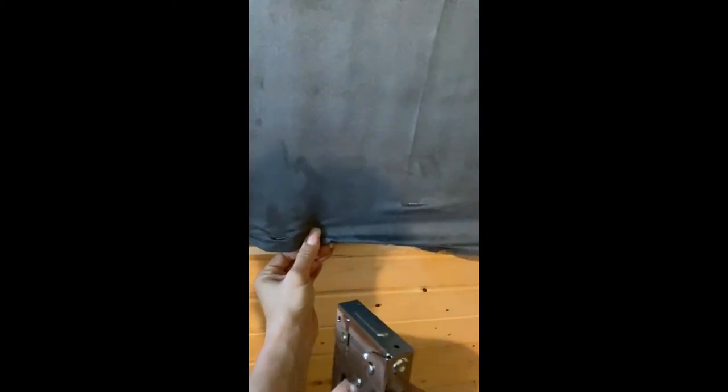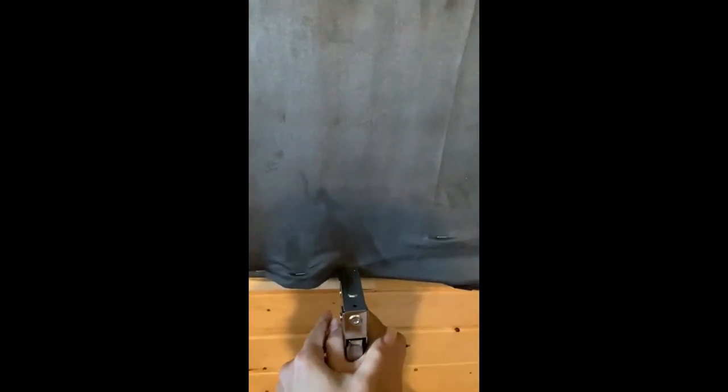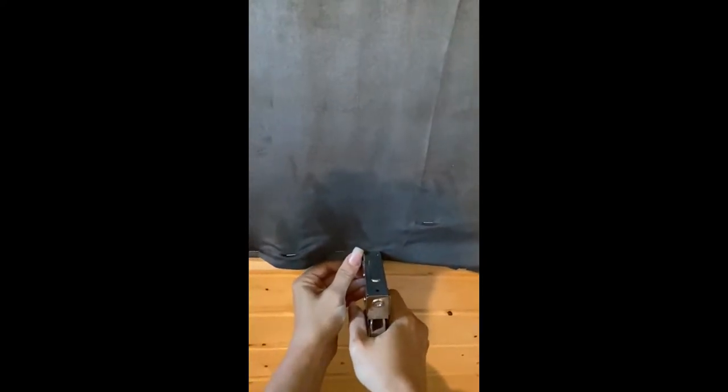You're gonna wanna fold and staple the fabric so it has really nice, beautiful creases. And make sure you stretch the fabric again so it doesn't get all bumpy and creasy when people start to sit on it and use it. Wrap the fabric all the way over the underneath side of the lid. So when you open the lid, it has this beautiful sleek look to it.